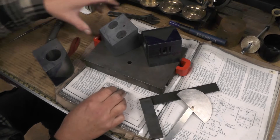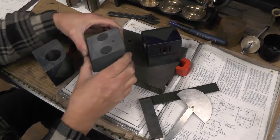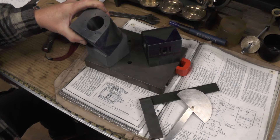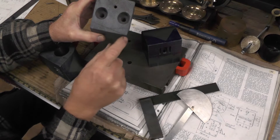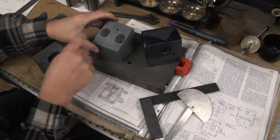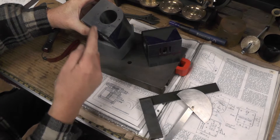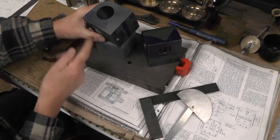What I've done is I've cut this block of wood, squared it all up, and cut it at 20 degrees, so that's giving me my first angle - 20 degrees. Then I've drawn two lines on this block at 12 and a half degrees, one each way. The reason the lines are drawn both ways is because when you put your cylinder on this block, it's got to be in one direction for one side, and then when you turn it over it's opposite, so it's got to go the other way for this side.